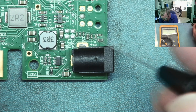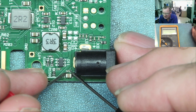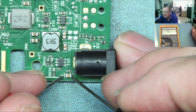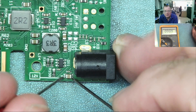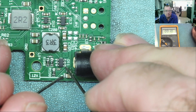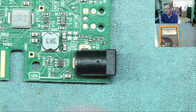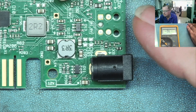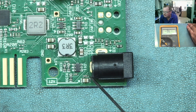I have quite often seen this little capacitor here go short — we'll read it short here for sure. Same as there. And this chip I've seen goes short as well. So it's probably one of these three components. I think we can stick some current into this, get the thermal camera, and hopefully it'll show us which one. I wouldn't be surprised if it's that capacitor.